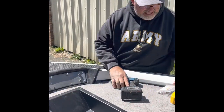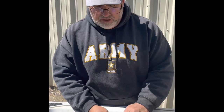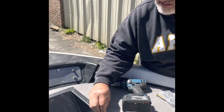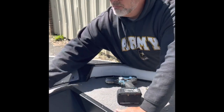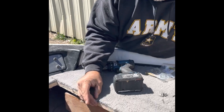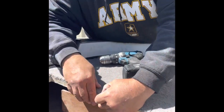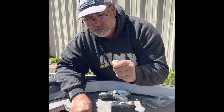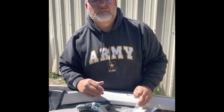We're going to drop this down in here and start pre-drilling some holes. The correct size screw for this is a number eight, three-quarter of an inch. You can always go bigger, but you can't go smaller — so once you drill something out, you better make sure it's exactly what you need. If the customer wants to go with a size 10, he can, but I'm starting with a small screw. As we look at the depth, it's going to go down approximately that far — I'm not going all the way through just in case. Starting with a small screw gives the customer the option to go with a larger screw in the future if something should ever happen.